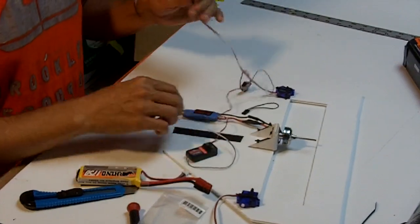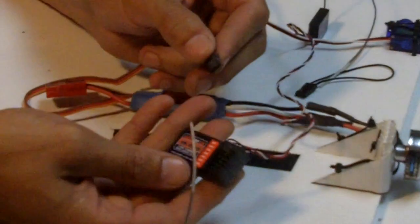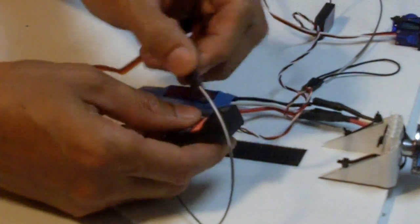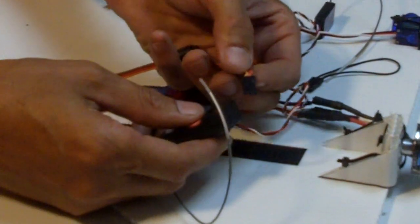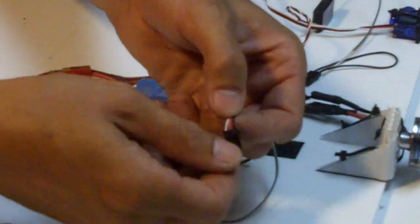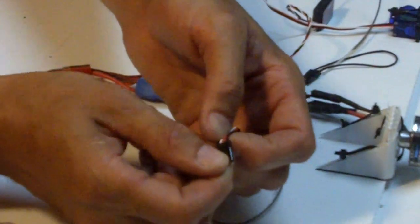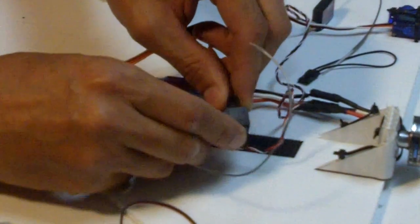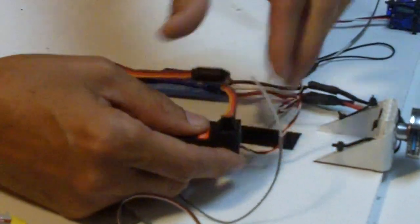And we're just going to connect our speed controller to channel 3 on this receiver. So it's marked down here, and the brown wire is going to go towards this edge here. This is ground. They share a common ground along this edge. So brown is ground, red is hot, and yellow in this case is signal. Other servos have black as ground, red will remain hot, and white will be the signal in that case. These are the two major color schemes that you see. All right, so this will go into channel 3. That slot, be gentle, get it in there, make sure it's seated pretty well. Brown is down to there.